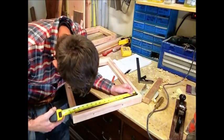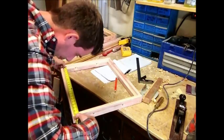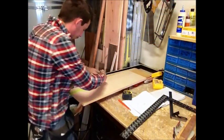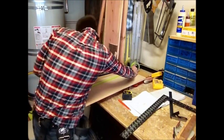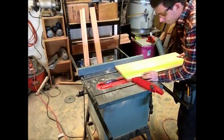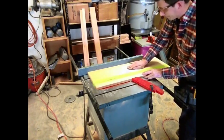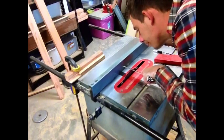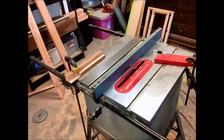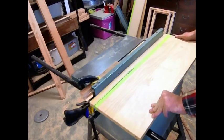To start work on the extension table tops I measure the width and length of each table. As always I make sure to measure twice and cut once. The top panels are going to be made from an old shelf that's particle board and melamine. To reduce tear out I use masking tape to cover the cut line. I cut the two left top panels to a total width of 15 and 15/16 inches, then readjust my fence for the right top panel, making sure the board is flush against the fence for an accurate cut.